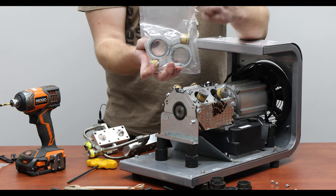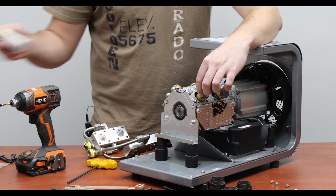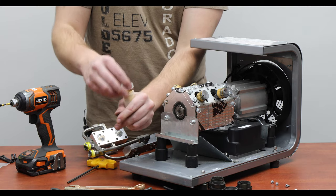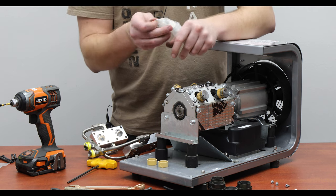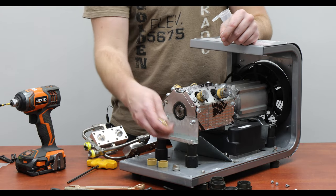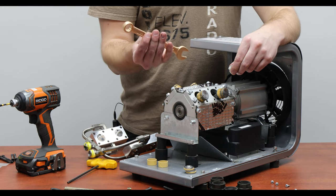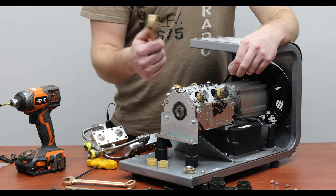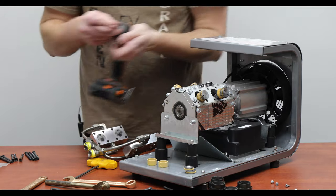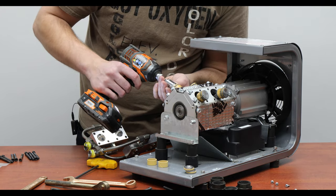One of the rebuild kits we offer for this pump comes with the bearing for the rod and the piston up top. What I'll be doing is just taking off the top end of the piston and replacing it with these gaskets — it's the easiest and quickest rebuild that we offer. The kit includes two wear rings, a tool that you're going to use for the top of the piston, and two new piston tops. You're going to need a 5/8 wrench — I have this spark-free wrench here. You can also use an adjustable wrench or a 5/8 socket. You can use a drill with the 5/8 socket attachment to take it apart, but be very careful not to strip anything out, because you don't want to deal with broken parts later.